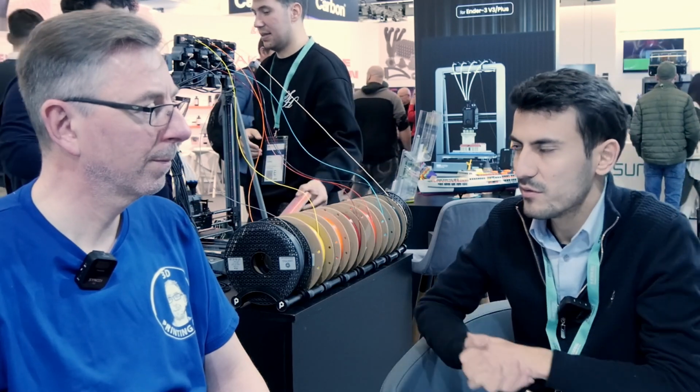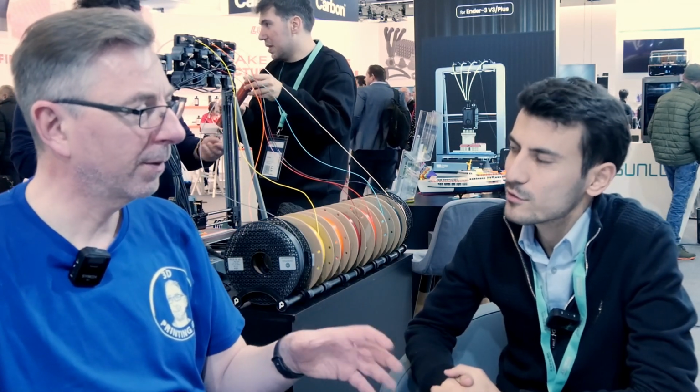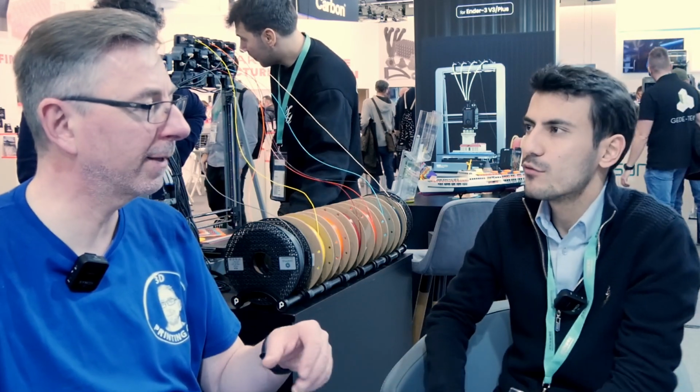After that, now Chroma has 3 modules: the Chroma hot end, the filament cutting mechanism, and the extruder module. And as you say, it can be more changeable. It will be easier for users. And it has a built-in accelerometer, so you can do input shaping. Of course. And you don't have to use a separate accelerometer to do that. Of course. It's a one-in-all solution. Yes, we aim for that. But it's big. I found on my K1 I lose about 40, 50 millimeters at least.